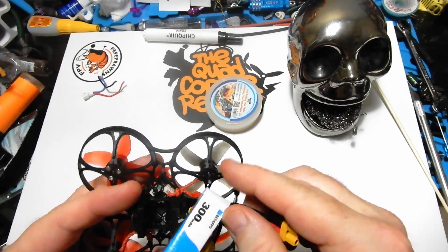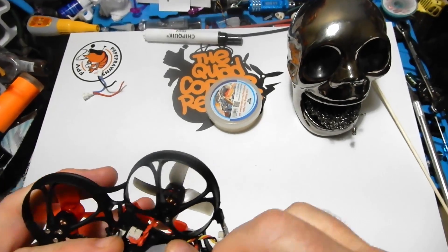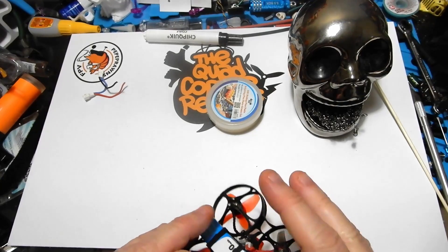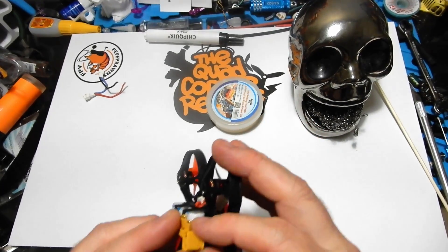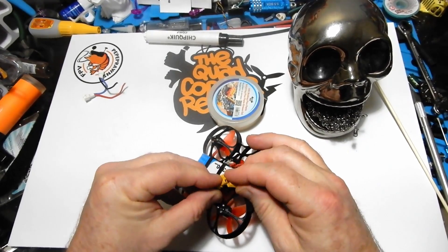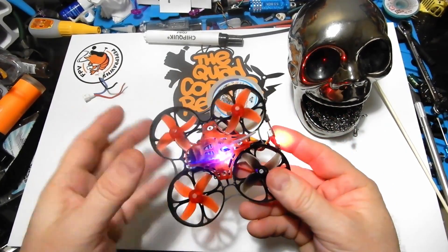One of the subscribers wrote in and said on those 1S batteries, you could take two and put them together, use some shrink sleeve, and heat it around both of them. That shrink sleeve will add some millimeters of thickness to the batteries and probably take out that slack we were seeing in the 1S battery slot. Just like these 300mAh batteries here that have a clear shrink sleeve on them — same concept — you'd just make your two 1S packs into one combined 2S.